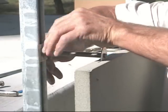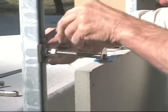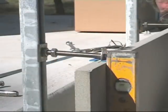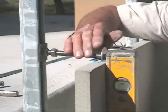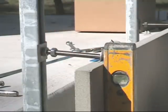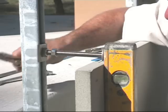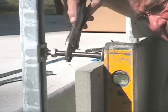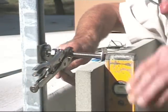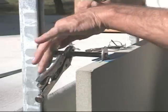The clips are inserted into the panel and the first locking nut is secured onto the back washer, and we check the panel for plumb. We have to bring the panel out a bit, so we lock the back nut up securely on the shaft. Then we use a pair of vise grips around the thread to move it in the reverse position to move it out to plumb, and then re-tighten the nut to affect the finish position of the panel. It is now plumb and level.